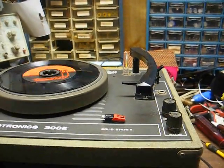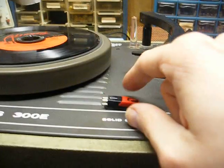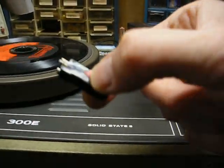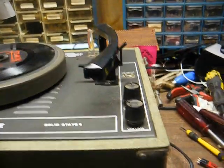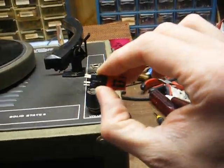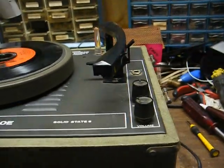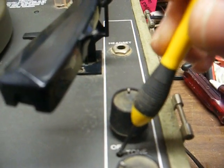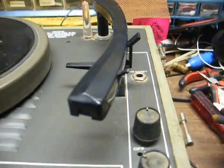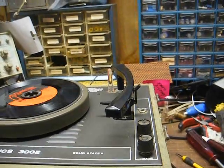I've done some work to this little Audiotronics record player off camera, but I'll go over my findings. This little Crosley cartridge is not going to get it — that's out of the question. I adjusted the gain pot on the amplifier, accessible through this hole here. I turned it wide open, and that still didn't give me satisfactory volume levels.